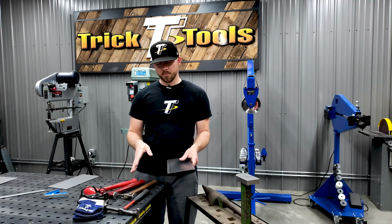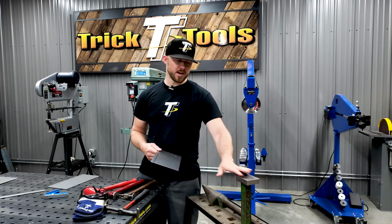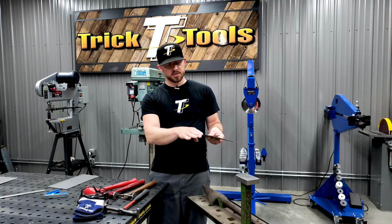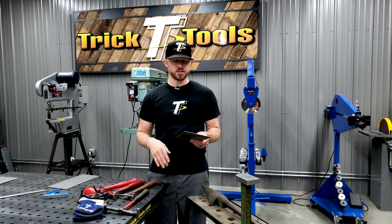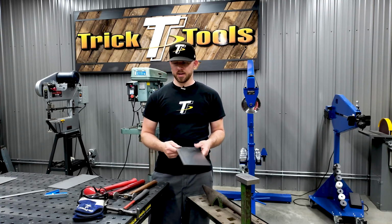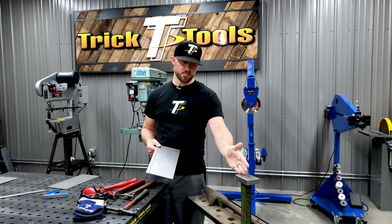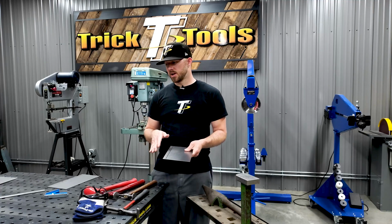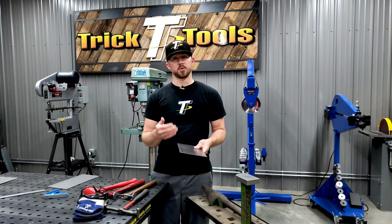So I'm going to show you how to do that with a hammer. I've got an old Pexto stake here that I'm going to be using to hammer on, to show you guys a process that I use when I want to use the hammer to tip an edge over. Maybe you don't have access to a bead roller or another machine and you want to put an edge on something. You can still do it with as basic of a tool as a body hammer and even a dolly. I've done it on a dolly clamped in a vise or something like that, or these Pexto stakes work great for that. So I'm going to show you how to do that with as minimal distortion as possible, and then show you what would happen if you were a little too aggressive and how much different the flange and the panel would look once you're done.